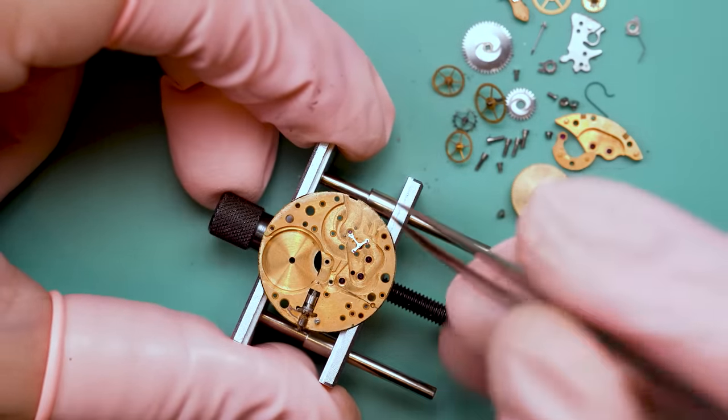These are actually looking very, very good. Here's a jewel I took out for this cleaning and detarnishing process — it looked fine. These ones could use a little bit more cleaning so I can get in there with the Rodico to just get any debris. This one has a little tiny bit of something stuck in there, so I'm just going to use a little smoothing broach to clean it out real quick. And that's what it looks like afterwards — fantastic.